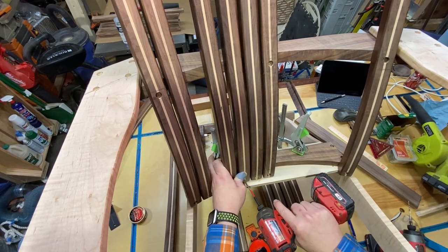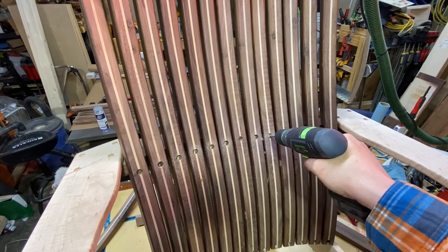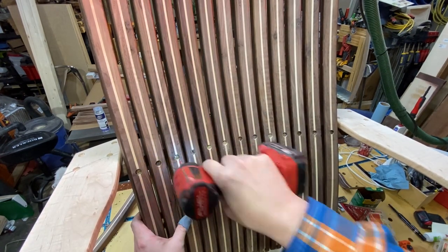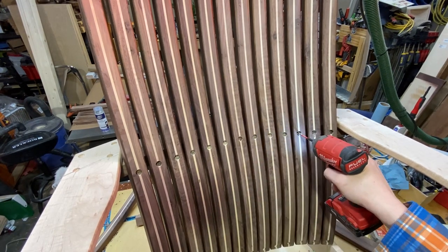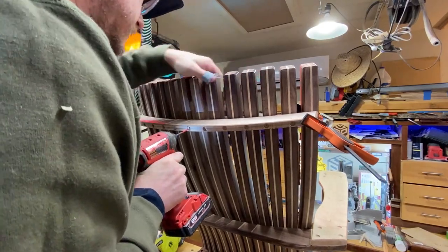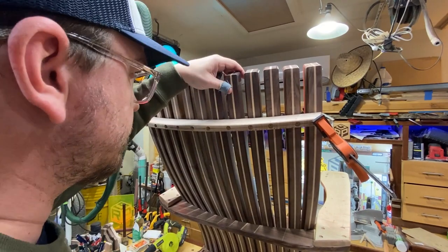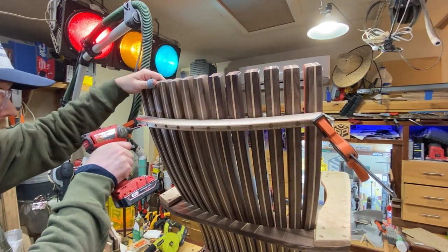Then I just attached the bottoms. I drew a straight line so I could pre-drill with my half-inch Forstner bit across the back cradle — this actually took me quite a while to draw nice and straight because it's going to be super visible, since those are going to be maple plugs and you'll definitely see the inconsistencies if you don't take the time to line everything up well. The top cradle is important because it holds the back slats nicely and evenly spaced — especially as the seasons change and the chair gets rained on, the wood is going to try to move and twist, so having this ensures they stay nice and straight over time. I screwed in the middle slat to the back cradle, leveled it out, and then screwed them in from the back. You need to pull it pretty tight to get a good screw connection when coming in from the back side.